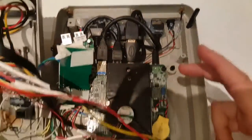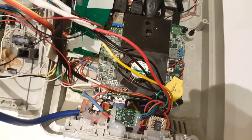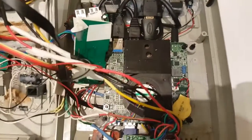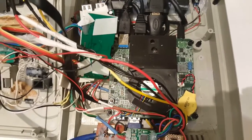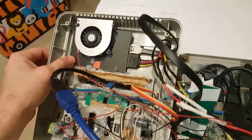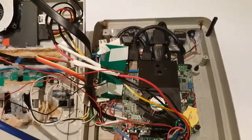The motherboard itself is a NUC motherboard — it's a D54250WYB. It runs an Intel i5-4250 with Intel HD 5000 graphics and Gigabit LAN. I also have onboard gigabit wireless with Bluetooth, as well as a 250GB SSD onboard and a 120GB Samsung Pro SSD as well. So I have two SSDs with a total of 370 gigs split across two drives, and 16GB of RAM.